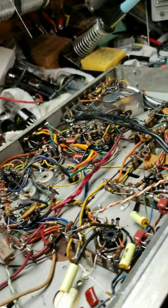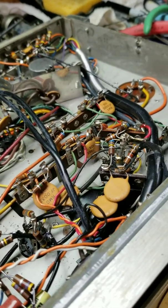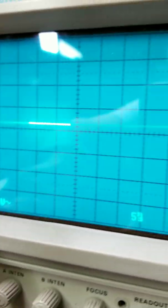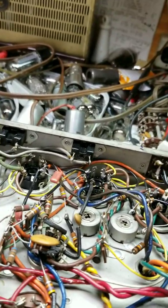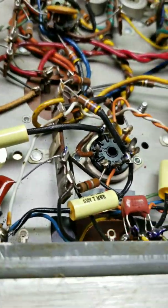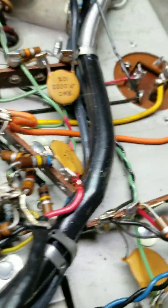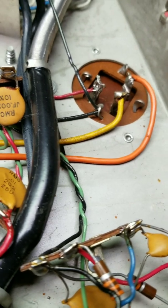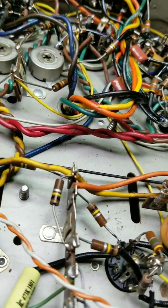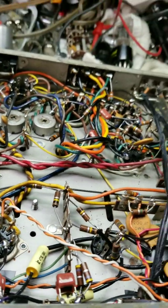The original — especially Fisher capacitors, but this is a Bell and they apparently used a very high quality capacitor also. So there you have it: that is your basics on how to check a filter cap with an oscilloscope. This one is a Tektronix 2247A — we have the luxury of our voltage settings right on the screen. You could also disconnect everything and check for actual capacitance, leakage, and all sorts of stuff, but this is a basic check. If the capacitor isn't getting hot, your scope is happy with what it sees, you don't hear any hum, and there's no issues with the amp — you're good. Automatic mass replacement is not a good idea.